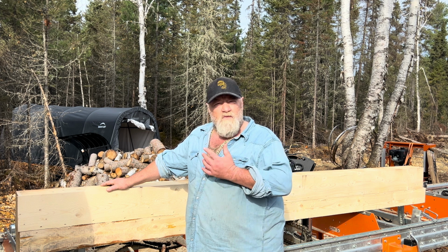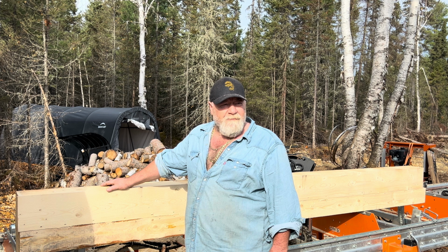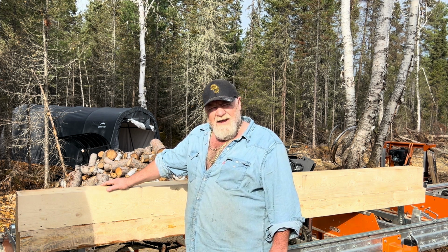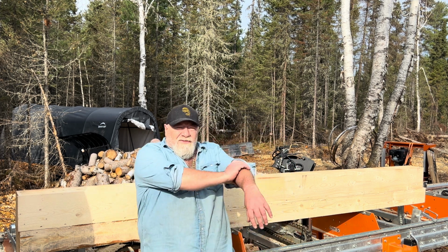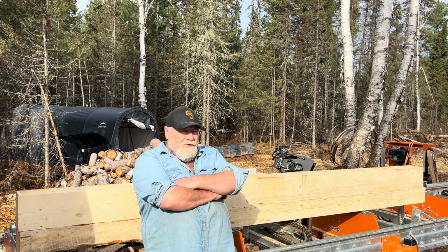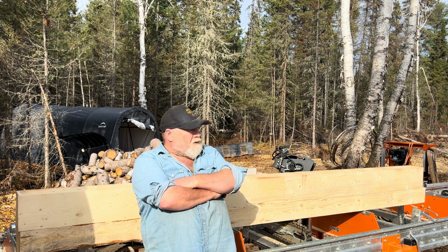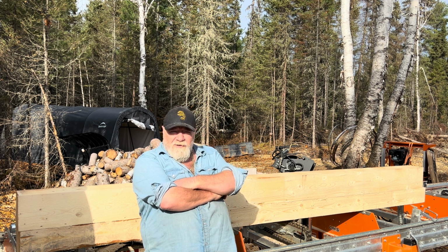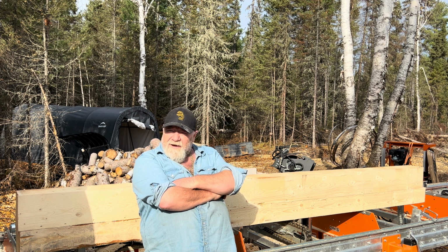It's always good to go more than. Being a foundation specialist that I am, you always want to give that safety factor. Sometimes they go 1.5, sometimes they go 2.5. I think I went like a 5 times safety factor the way I'm going to build this. Why? Because it's going to be structurally sound. And I'm building up here on rock. This is the top of the mountain itself, the highest point in the area here anyways.